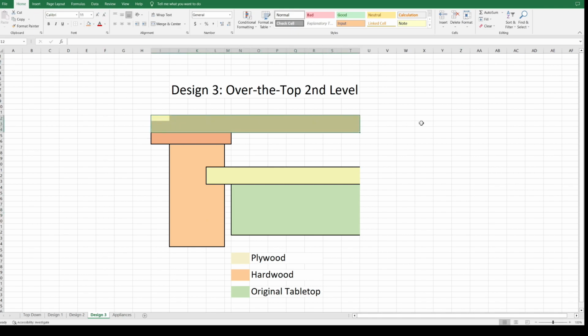Now, I'm not sure yet whether I'm going to try to do something to fix that in place. I think that can be done without too much trouble. Or am I going to just let friction be my friend and let this just sit on top without anything firmly holding it? When you're talking about something that's north of 8 foot by 4 foot, there's going to be a pretty fair amount of weight there, so I'm not so sure I need to do anything. That won't be seen until I actually build the table, and if I have to do something, I can put a little cleat right about there, and that would fix it in place in one direction. I put those around the table in various spots, and guess what? That tabletop is not going anywhere.